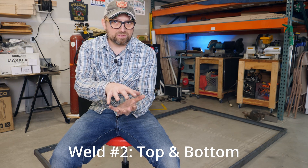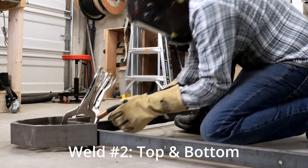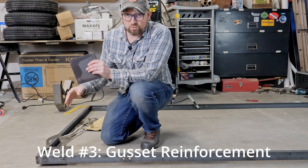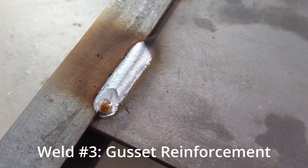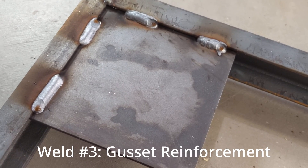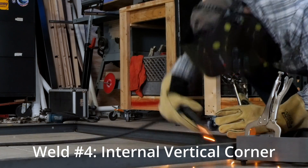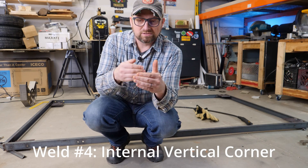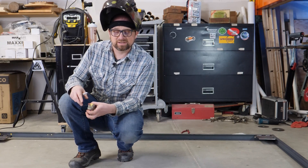The very first weld in the sequence is where we've already tacked — weld the outside edges completely. Next, weld the top starting from the inside going out, then flip the frame over and do the opposite side so both sides are hot at the same time and cool at roughly the same rate, minimizing movement. If flipping isn't possible, throw a tack on the inside of the channel or tube. Our next step is to weld a gusset into each corner — gussets add strength and are great mounting points for stabilizer jacks and the teardrop body. The last welds go on the inside of the channel or tube, which has the most leverage on the entire frame.